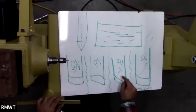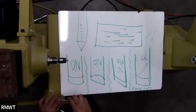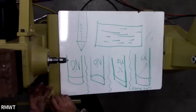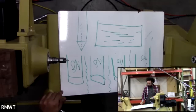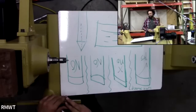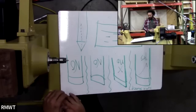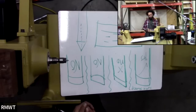You see here, the reason I would say no on a grind that you typically see from most manufacturers, when you get one straight out of the package, whatever package it is that you get a skew. It's ground usually at a right angle, which is about anywhere from 20 to 25 degrees. However, I find that the shape of the skew is usually dead wrong. And the reason I'd say that isn't because it won't cut efficiently in one way. However, it has its limitations, and its limitations are that if you have a tool that's sort of pointed at a right angle, it's very difficult to properly peel scrape, but it will plane well.